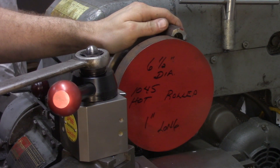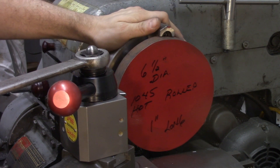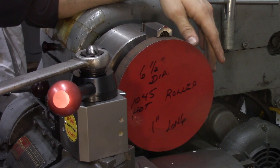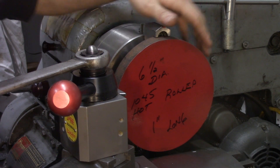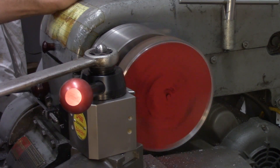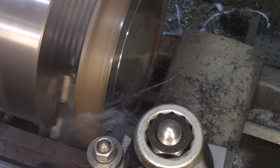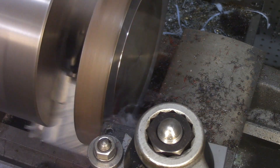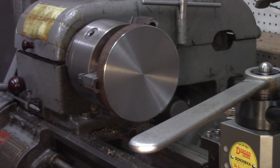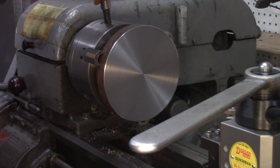This might just be the largest diameter piece of steel the lathe has ever had to turn. We're going to face it off — it has just a bandsaw finish on it. I've got about 13 thousandths to dig through before we have one face on it. That face is done; I put a nice little chamfer on there. Let's do the other face.